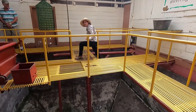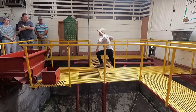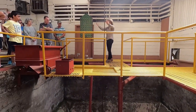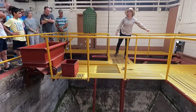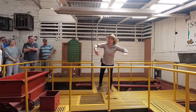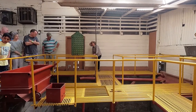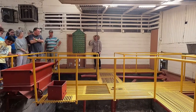That's a siphon that takes all that coffee and water from the bottom to the next station. But while this pipe sucks the coffee and the water, this pipe expels water to fill the tank, to keep it full. And that pipe expels water at the same time. Besides, the water power moves like a storm all the floating coffee and overflows through this hole in the wall. That's a separate channel that's taking the lower quality to the next station.